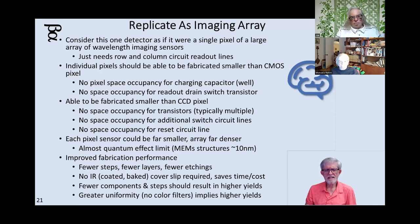Comparing against the CCD camera used in astronomy, you don't need the six transistors normally associated with a CCD pixel — there are no transistors, no capacitors, no reset line to discharge. It's always direct reading. How small could you make it? If you had the lithography technology, you could make the triangle dimensions down to 10 nanometers. Below 10 nanometers you start getting into quantum tunneling effects, where a photon might make no interaction with the triangle at all and just pass right between the atoms.